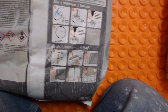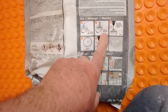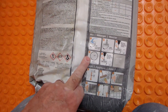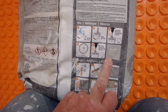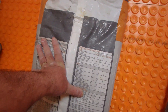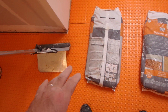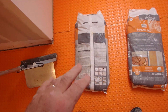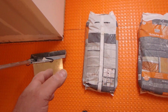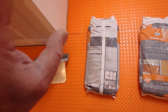All the directions on how to mix it are on the bag. This one actually has a pretty long mixing period. It tells you how much water to add with the powder, then you mix it for five minutes, let it slake for ten minutes, then mix it again for another three minutes, and then you can use it. You want to mix it according to directions to get the properties and performance you expect — a lot of guys will just mix for a minute and start, but you don't want to do that.